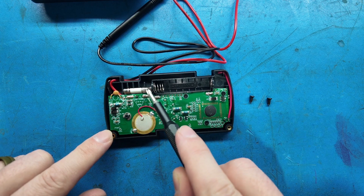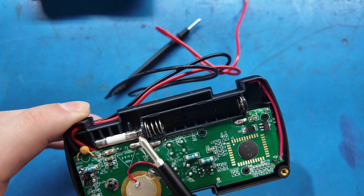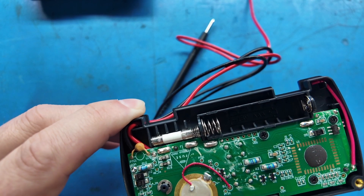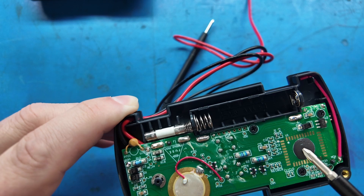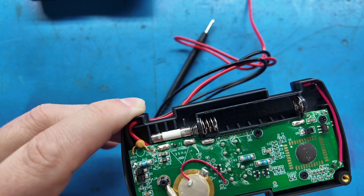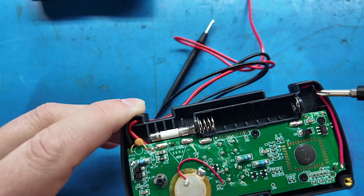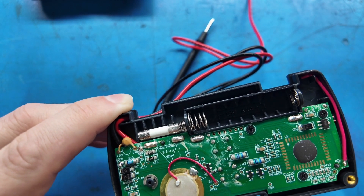Here's our battery holder. The fuse holder is a little sketchy — it's just a spring pressed up against a contact. My main worry is that if we take a jostle in the field or drop it, that fuse will pop out. We've got a blob chip bonded right to the board, a couple of mounting screws, a piezo buzzer, a metal E-clip, a PTC on the input, some diodes, a wire for the non-contact voltage, and a zebra strip for a pressure connection to the screen.